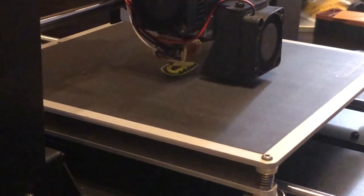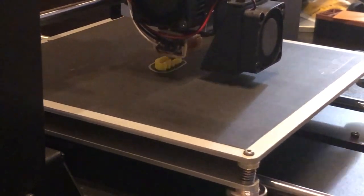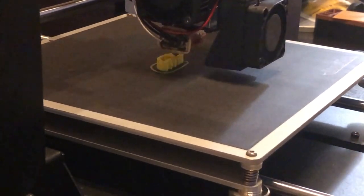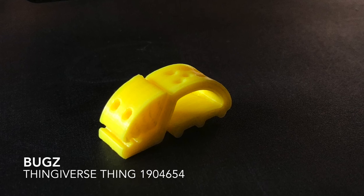The two drop targets in OctoPrint are left and right: dropping on the right uploads to the SD card in the printer; dropping on the left stores the file on the Raspberry Pi's SD card. The file is uploaded and now we print. You'll notice there are a lot fewer steps with OctoPrint. Instead of the old workflow — slice, save, walk to printer, remove SD card, insert in computer, copy file, eject, walk back, insert SD card, navigate menus — now you just drag the G-code to the browser window and click Print.